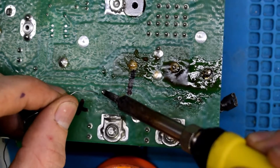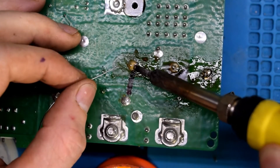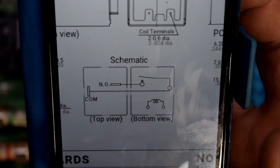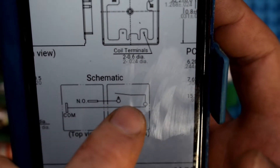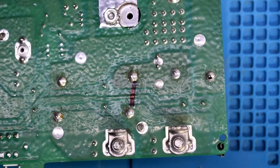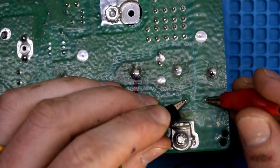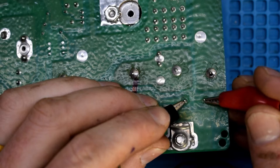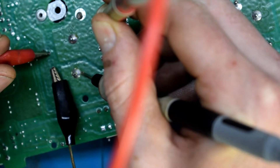I have a brand new hot tub now. I also soldered up a couple other joints just in case. It took a while to troubleshoot, but after I did that it worked. Here's basically a schematic of your relays — you have four pins, it's basically a switch from the top, and on the bottom you have a coil. You activate it with 24 volts and you should hear a click — that clicking indicates it's probably good, but again it could be a bad solder joint.